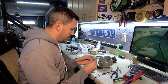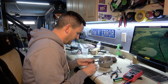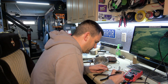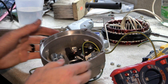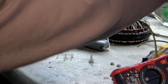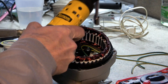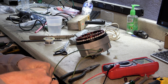So I got the positive brush and I guess what we really need to do is connect some wiring here that does not relate to this wiring. Our continuity checked out. We've got a positive ground for the top terminal and the second terminal goes just out to this wire here. We've soldered in our little diode — removed it from the on-board regulator and just looping that right out. So let's drop the coil back in.